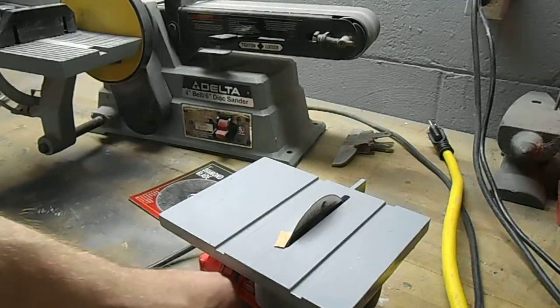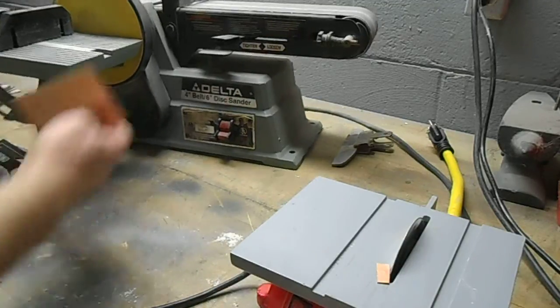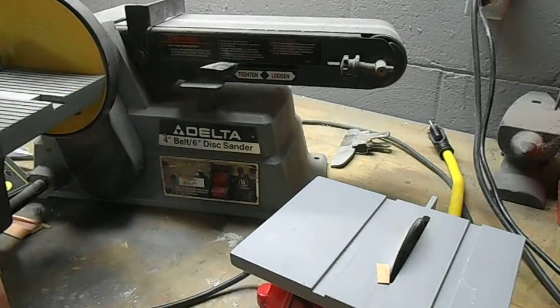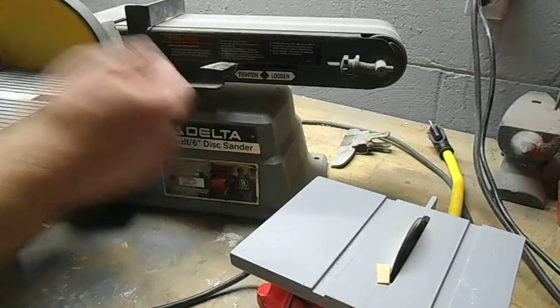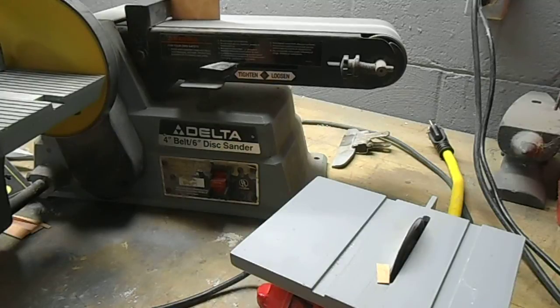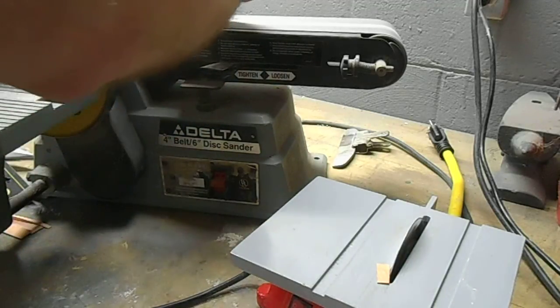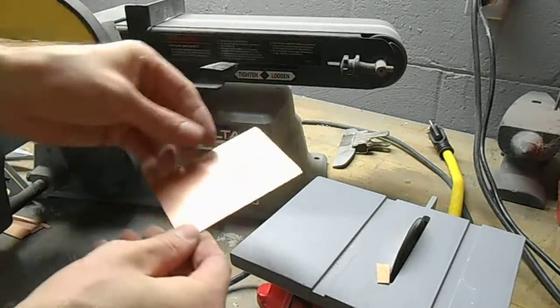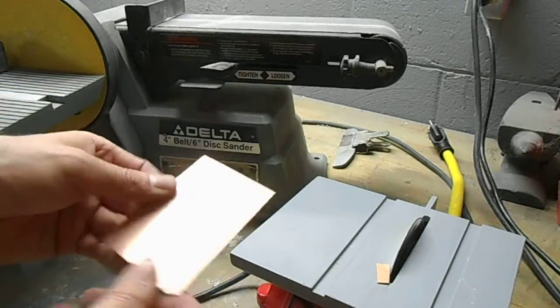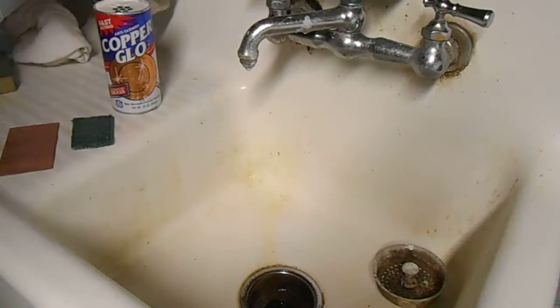You can do it all in one cut, which is really handy. For deburring, you want to deburr your board material — I use a standard belt sander with a 300-grit belt. That basically helps to square up your edges, makes it look nice, and gets rid of any burrs for a clean PC board.